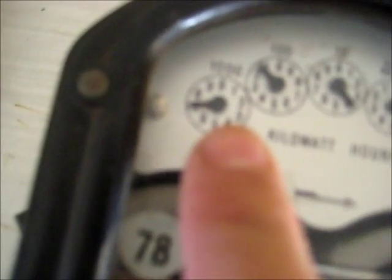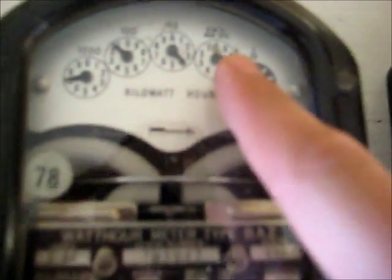There are timing marks right in the middle — you've got to look carefully at the timing on the wheel. This one doesn't actually have any numbers on it, and that one there does. This one's done 46,177 and a half, so it's halfway between the 7 and the 8. This one doesn't have a 10,000th unit — it just has a 1,000th and that's it — so this one has actually done 7,137 kilowatt-hours.